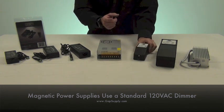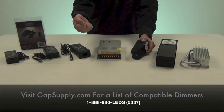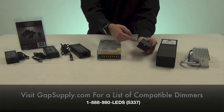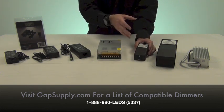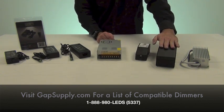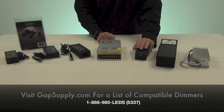With these you can either use a BX connector to knock out the half inch knockout and then use a plug-in whip to plug it into a power source that you perhaps already have inside your cabinet. The other option would be to hard pipe right into this, if you have a basement or a dedicated area where you're mounting all of your power supplies. It's very important to remember that you cannot dim on the low voltage side with these, as they will not work in that application.